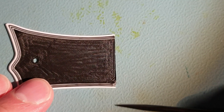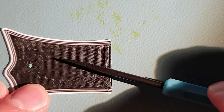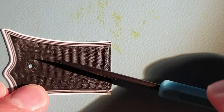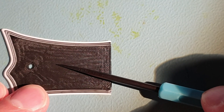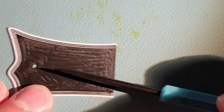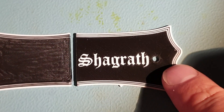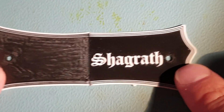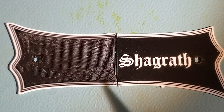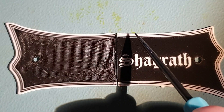It turned out that my flow value was really bad, and my K value for the white filament was also bad. Once I managed to calibrate those correctly, I got a totally different result when printing. Because those two values were totally out of whack, I could not print fine details — now I can.